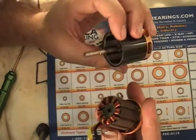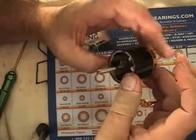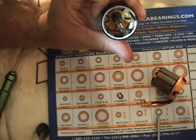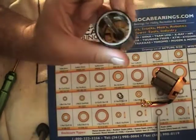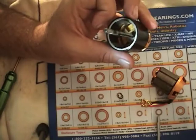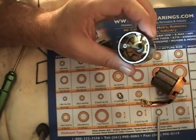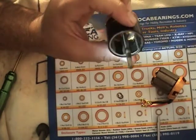Now to get the old bearings out — first take a look at the can. There's what looks like a little bit of styrofoam or packing foam in between a couple of the magnets, and somebody on the forums tried to scrape that off. You don't want to do that. That's a putty they use to balance the can. They spin it up to around 25,000 RPM on a balancing machine to find the imbalance point and apply putty. So you definitely don't want to remove it.